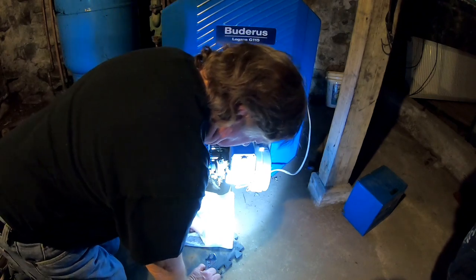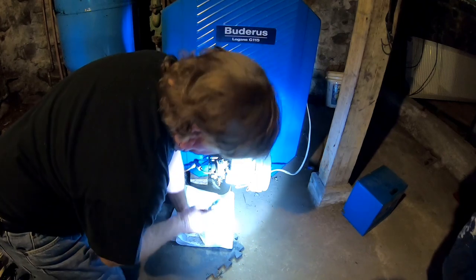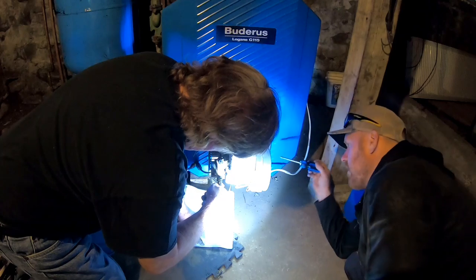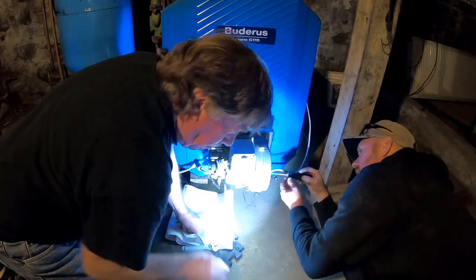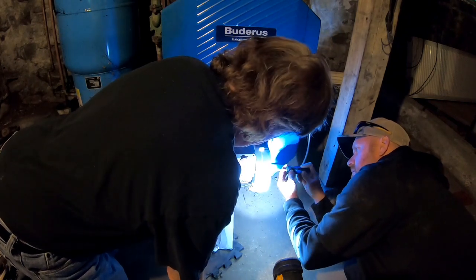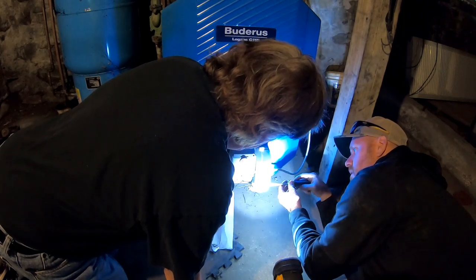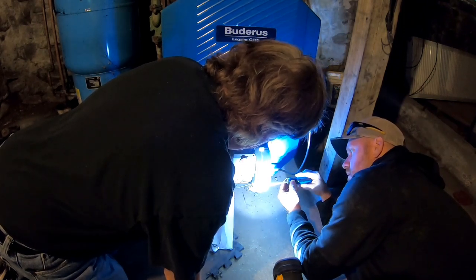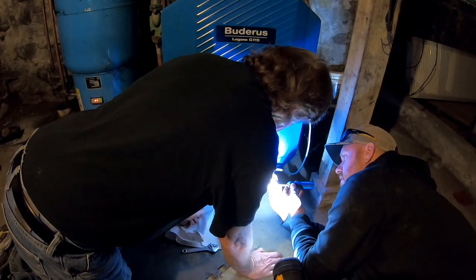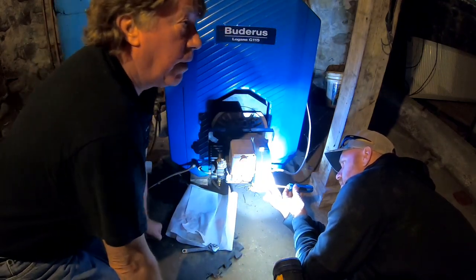The setting for the air with this nozzle — as specified — should be at 5.2. Paulo just texted me that. We're at about one. The air was restricted a bit too much to reduce the flow of oil, because we had too much oil coming in. That's why it was restricted. He went right to the model number and got that spec.